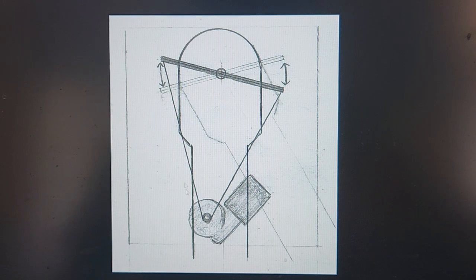This is what I did on mine. I have my two legs on the side of the droid connected by a giant pipe axle in the center. There's a heavy-duty lever on them and here's the motor with the spool. The cable attaches here, comes down, wraps around a few times, goes through the center of the spool and continues wrapping — I don't want the cable slipping on the spool. It comes out the other side and attaches to the lever. When the motor rotates, it draws in on one cable, lets out on the other, and forces both legs from vertical to angled back.